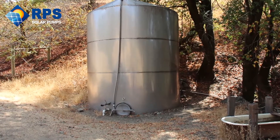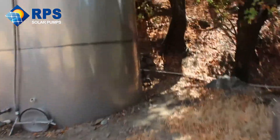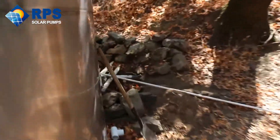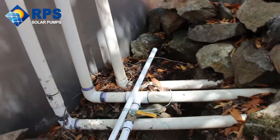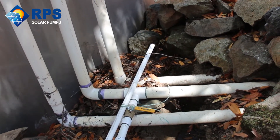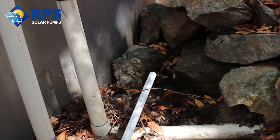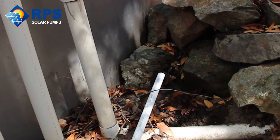Okay, so we're up here at the storage tank. It's actually around a 12,000-gallon storage tank — it's an old wine fermenter, all stainless steel. The piping came running up the hill here and right off to the side. It's not plumbed in yet, but we're just pumping a little water to see how much we get. At about 100 feet of head, we're pumping anywhere from four to six gallons a minute. This is three-quarter-inch line that we ran up here the thousand yards. If we had gone with one inch, we probably would have gotten more like seven or eight gallons a minute, but because the spring only produces a few gallons a minute and we only want to pump a couple thousand a day, this will do just fine.